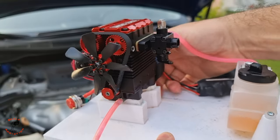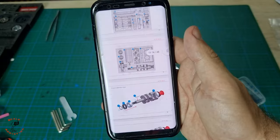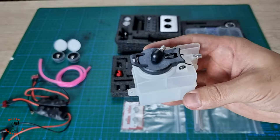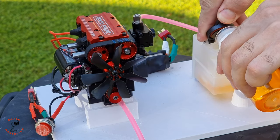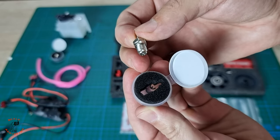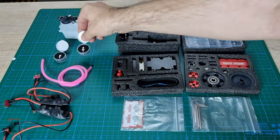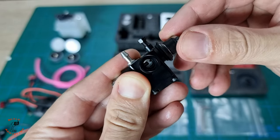In order to have a complete engine like this you have to assemble the engine kit, which comes in separate pieces. You can download the assembling instructions and it's very easy to follow. Here are some of the parts — this is the engine cover, the quality looks very good compared to the engine size. This is the fuel tank, which will be filled with 20 to 25 percent nitro fuel. This is the glow plug, which does the spark plug job. When the engine uses nitro fuel it has a glow plug instead of a spark plug.